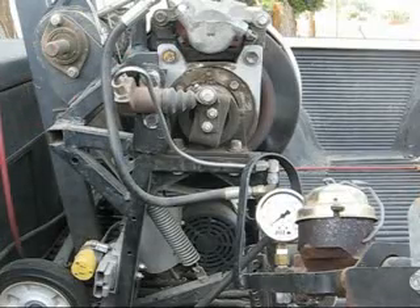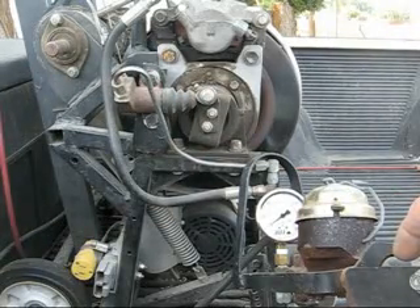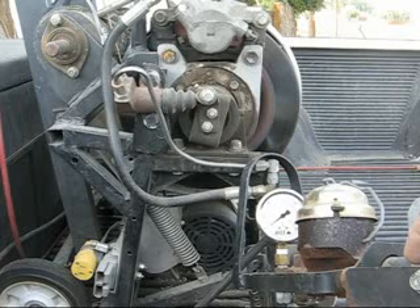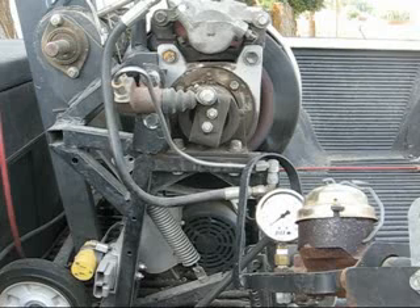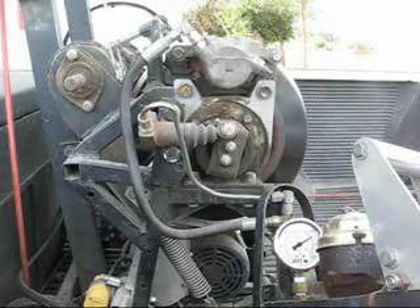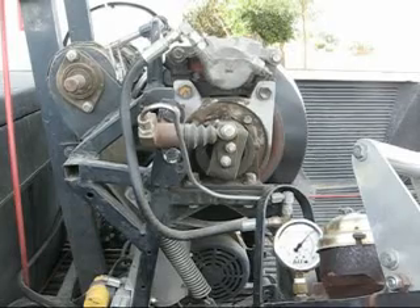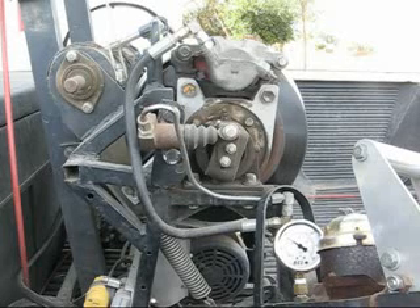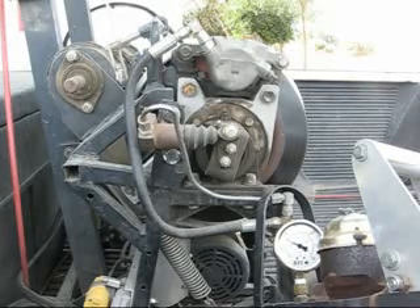The system is completely automatic. It takes a little bit to get everything at the exact right dimensions — you want a very subtle movement in the actuator to the slave cylinder, and just the right spring tension to work the right range of travel that keeps you governed in the correct tow line tension. If you lift off the truck and begin towing, the pressure drops down to its preset point, where the tension of the spring releases enough to drop the hydraulic pressure so that you achieve an equilibrium in the system, giving you your net tow line force.